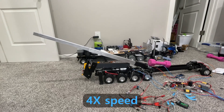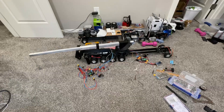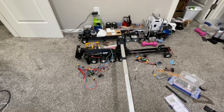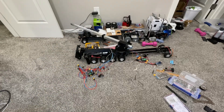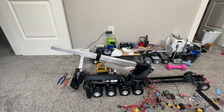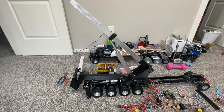Next I moved on to the rotator and crane system. This uses two aluminum square tubes that create the crane boom. The rotator is driven by a 360-degree servo that has a gear mounted onto it, and there's a gear printed into the base. I then added the lift actuator and tested the travel of that.